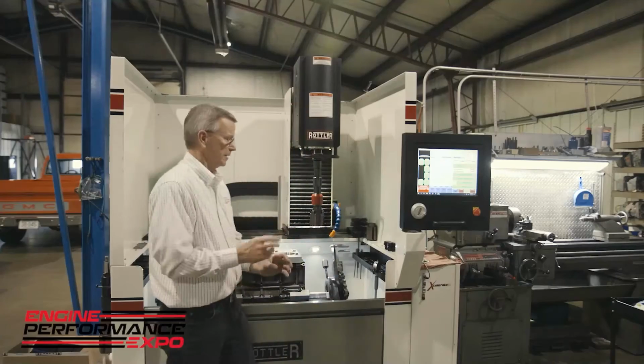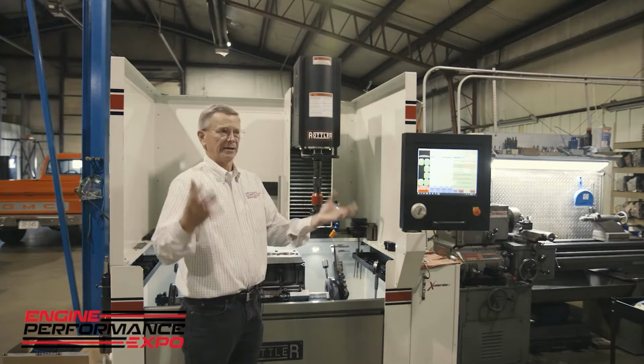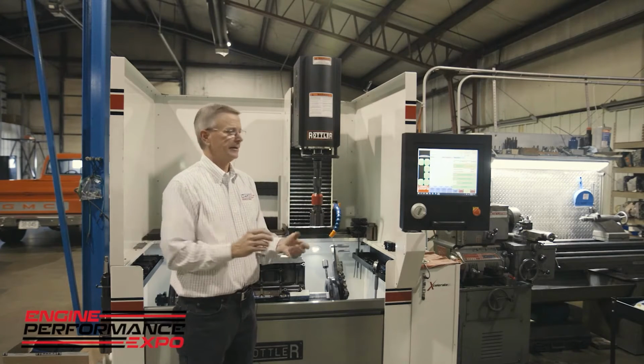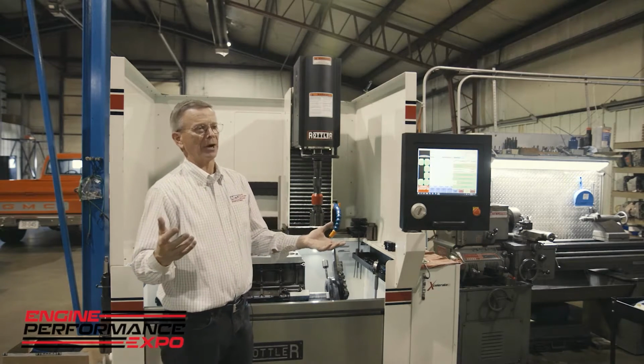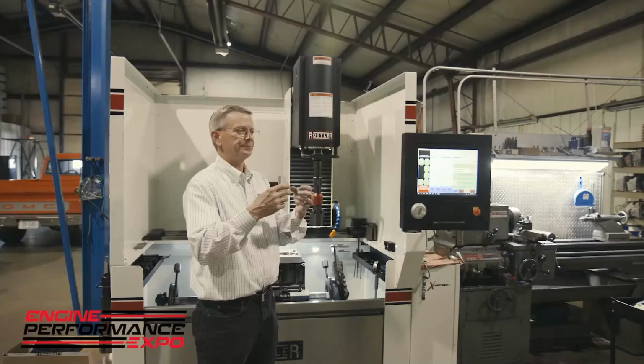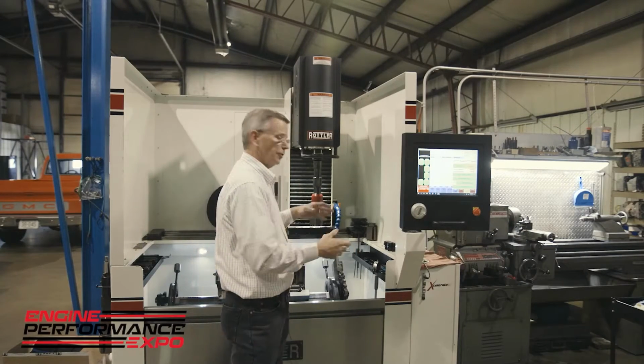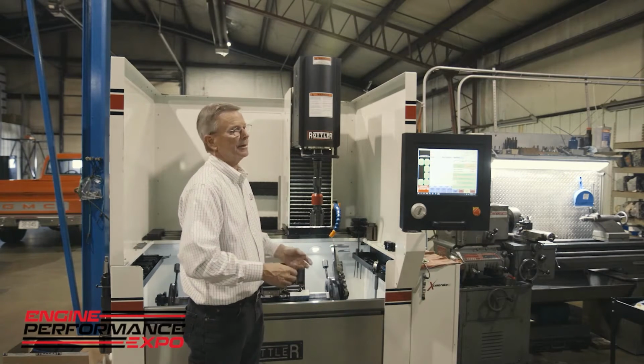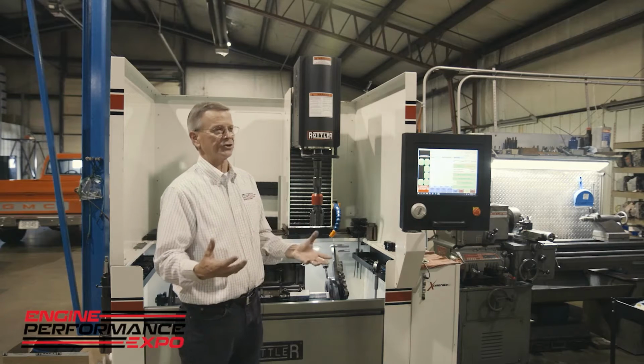Having said all that, the only other thing I'd like to address is I get the question constantly, oil versus water-based coolants, okay? I don't know if there's a right and wrong answer. At Rottler, we recommend water-based coolants. I know the fellas at Total Seal prefer mineral-based coolants. I don't have a preference, honestly. The water-based coolants are easier as far as, you get a 5-gallon bucket, makes roughly 70 gallons of coolant. So it's real simple, doesn't cost you a lot of freight.